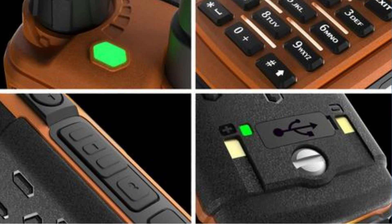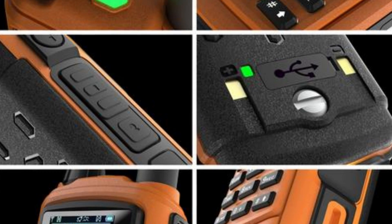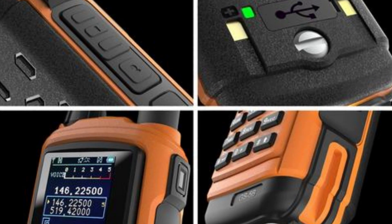New from Radioddity is this dual-band GS5B. It has an app you can download from the Radioddity website, both for Android and iOS. Check the link below for the page that goes directly from the YouTube description to the page for this radio. On that page it has a QR code, both for Android and iOS, where you can scan and download the app into your phone. Then you can use that app to program memory channels, VFO, and back-end radio settings into the radio.